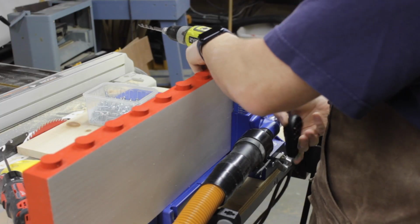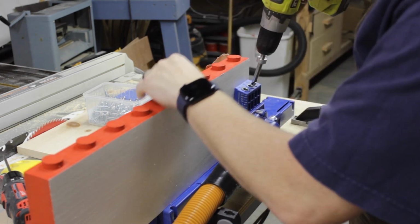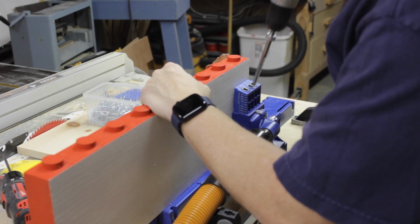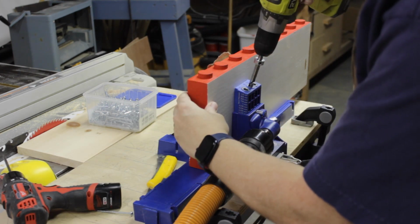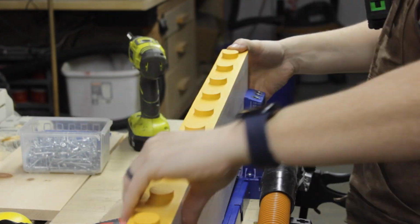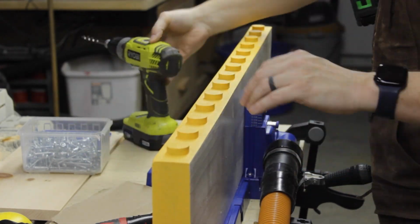Now on to how I will be installing these on the wall. And I'm using your favorite of mine, pocket holes. Now I'll be screwing these into the studs, so I went ahead and measured 16 inches on center for each of these. Some of the shelves will have two, some will have three. It all depends on the size. Gonna hit as many studs as I can.